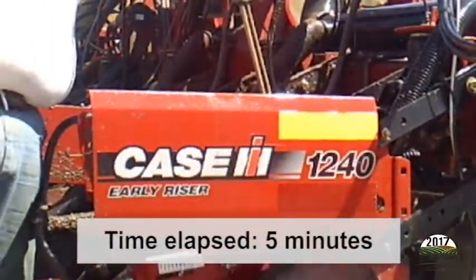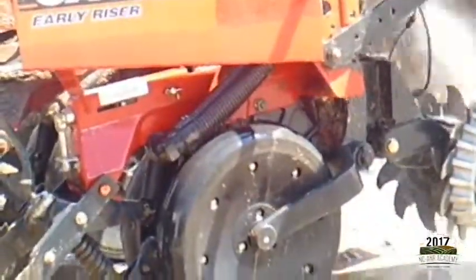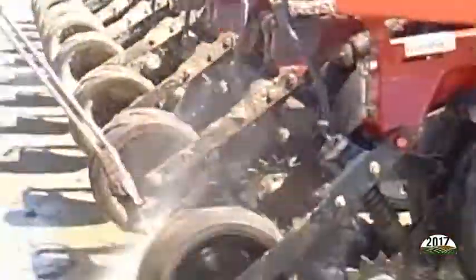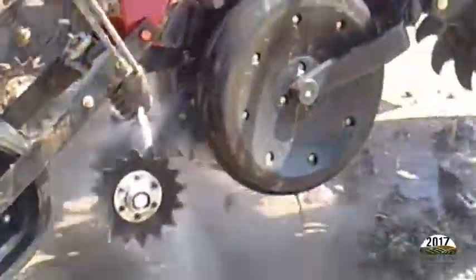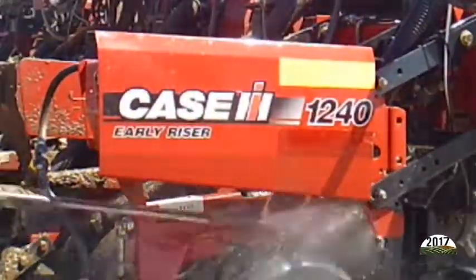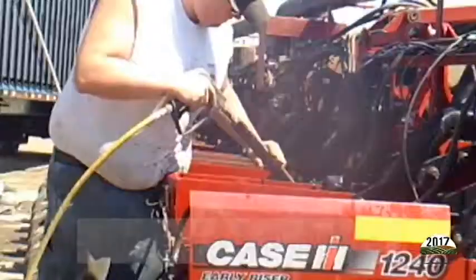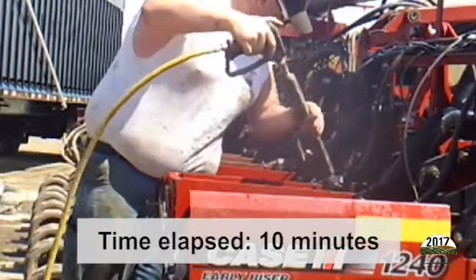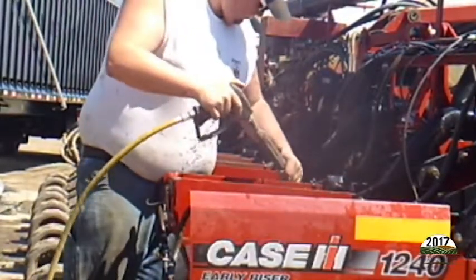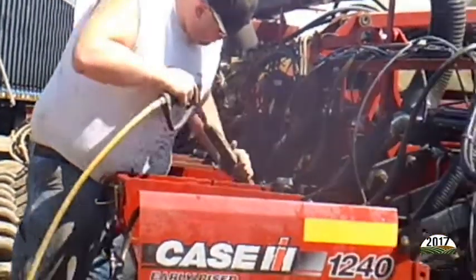During washing, choose the correct nozzle or tip for your power washer and hold the unit two to three feet from the surface being cleaned. Pre-soaking is recommended to loosen material and increase efficiency, saving time and water during cleaning. Work from the top of the unit down towards the bottom to avoid biomaterial, soil, and debris running over cleaned areas. Use smooth, left-to-right horizontal motions covering a three-to-four-foot area in one pass — this method will increase the efficiency of your movement.